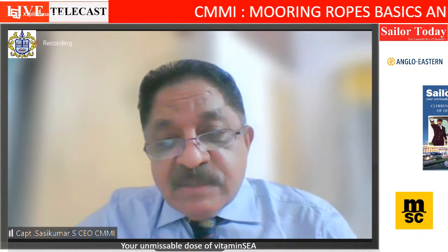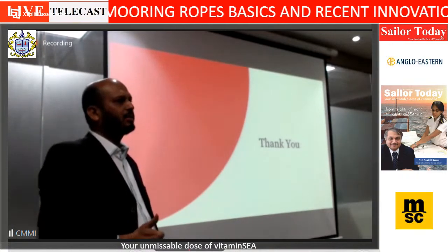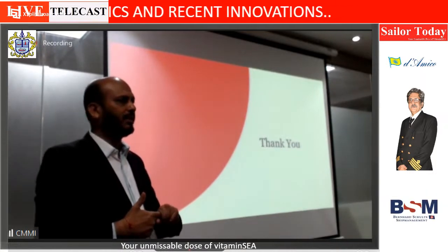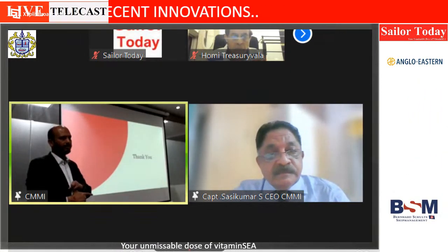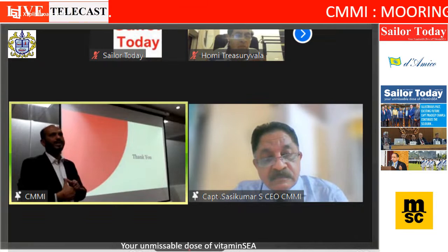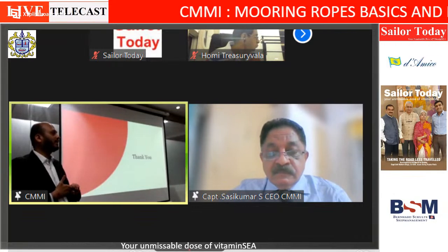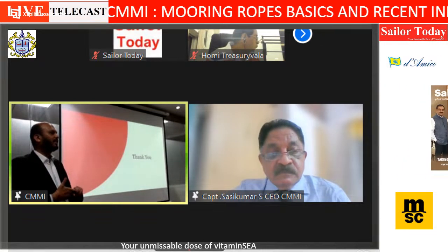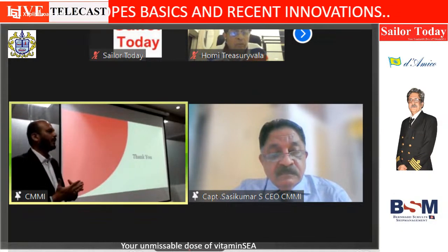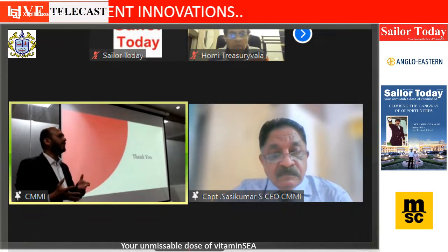Please explain mixed moorings. That's from one of the audience. So, a mixed mooring could be of two or three varieties. One is mixing of steel wire with synthetic fibers. Second is mixing of high elongation material with, say, HMP, which is a low elongation material. And the third could be mixing of materials of multiple rope manufacturers. While the breaking strength may be the same, the elongation characteristics may be different.